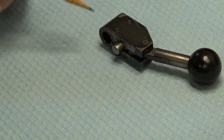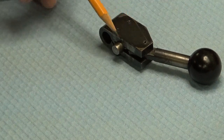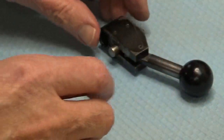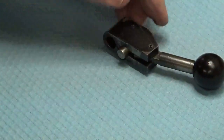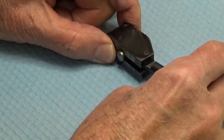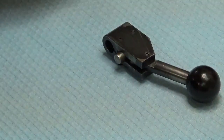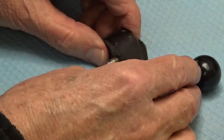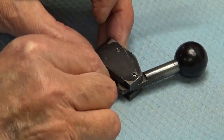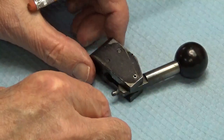This is where the shaft went that actually changed the gears in the machine. This little box has a pin in it and that pin has got a spring. When you push it down, the pin is drawn into this assembly. This lever has got a little pin that serves as a hinge for it. And if you push it up, you can see that the lever has a small pin on the end that sticks into a hole in this pin, and there's a spring on the bottom that gives it a retraction effect, pulling the lever back.